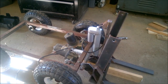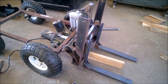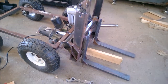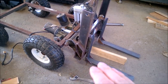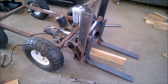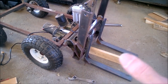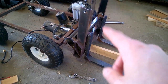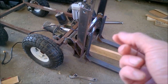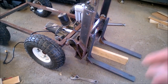And I'll just kind of tack it in light. Well, we'll get there. Hold your horses, boys and girls. Just realized I messed one thing up when I welded those forks on perpendicular, resting on the ground. I actually wanted to be able to give it like maybe 1 inch down travel in case the ground was uneven and I had to go a little bit extra lower than these tires. It's too late for that by welding on the top, but I could still do it by cutting the forks there and welding in like another inch. It'll be fine. I might not ever even need that, so whatever.